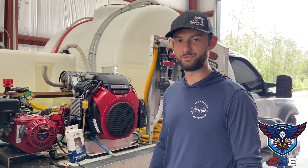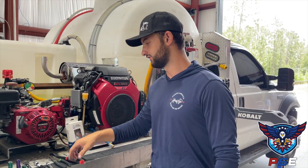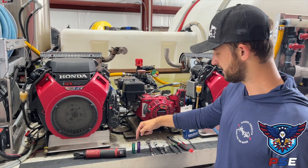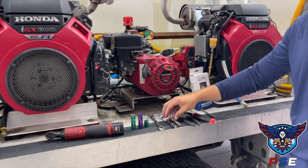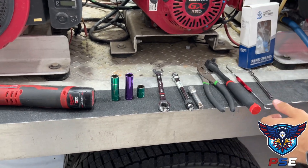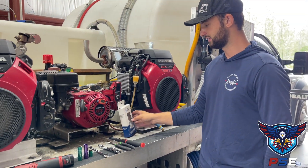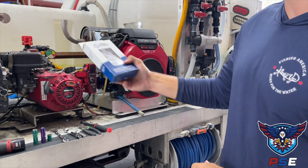What's up guys? This is Austin Pratt with Proper Spray Equipment. Today we're going to be changing check valves on the AR45. Here's a couple tools that you're going to need: some 3/8 drive sockets — a half inch and a 13 millimeter. You'll need two deep sockets of each and one shallow, some miscellaneous extensions, pliers, a ratchet or power ratchet, a pick, and most importantly a magnet to get some of the set screws back in. And you'll need the check valve kits for the AR45.